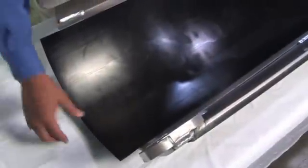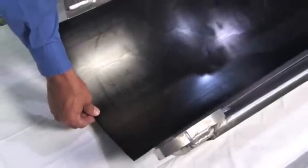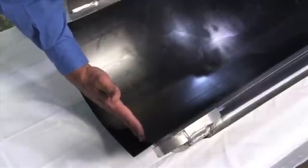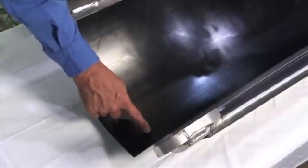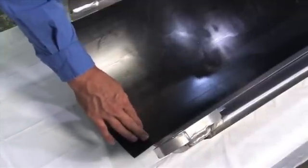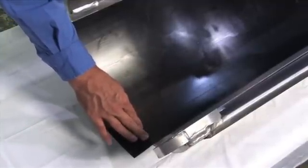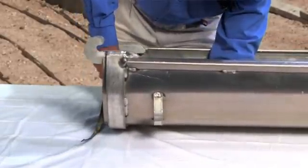You may notice that we've oversized the part a little bit — that gives us something to hold on to. If you try to cut the piece exactly to fit, there can be some variability during installation and you might end up a little short or a little long, which may create a potential catch point. So the idea is to oversize the part, and then with a razor knife you can easily come in, cut off the excess, clean it up, and your part will look fabulous.